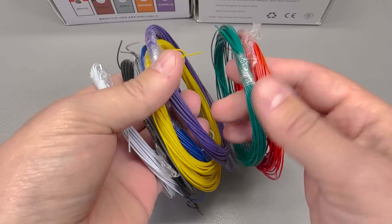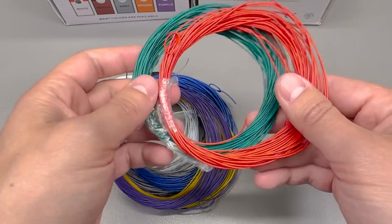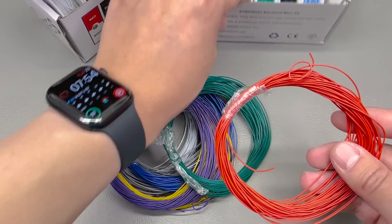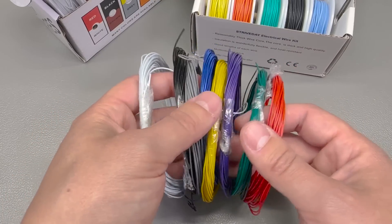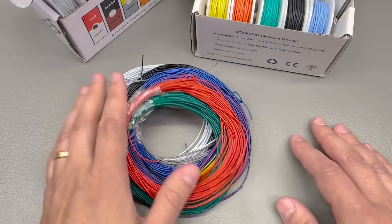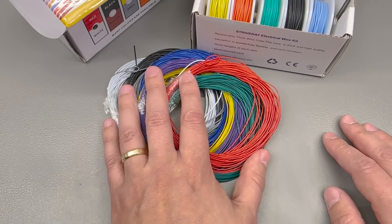I also got some PVC insulation wire — UL1571, 30V rated, seven strands of wire inside a 0.9mm outer diameter — which seems just about the same thickness as the newer silicone wires. I have eight different colors here which will be helpful, though they don't come as a kit on spools so I'll just keep them in a zip-lock bag. I'd recommend getting as many color options as possible.